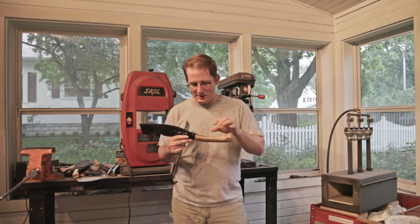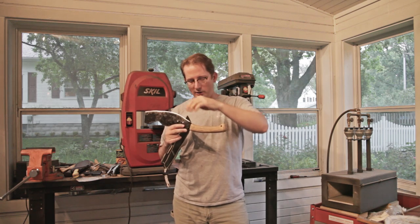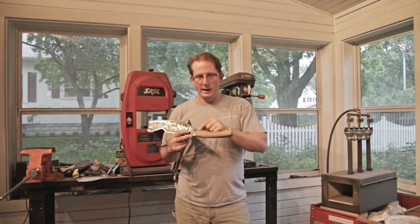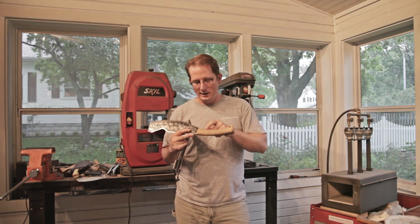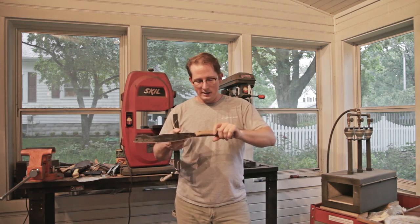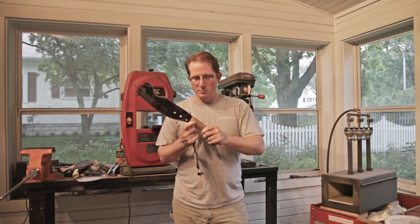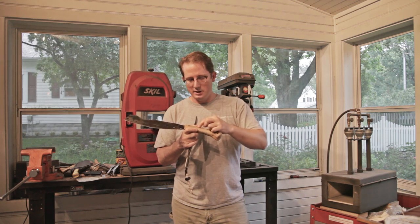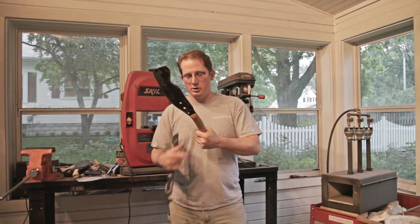The problem is that the tang in this area is thinner and it kind of juts out, and at the time I didn't have a grinder powerful enough to grind that flat, so I just filled it with epoxy — and then the epoxy came out. But the handle scales are just fine. These pins are basically brass, and I countersunk and then hammered them into the countersink so that they're flat and the handle is actually pinched onto them.